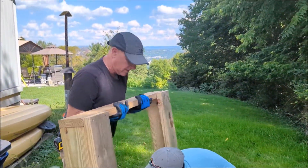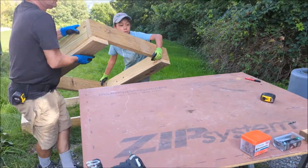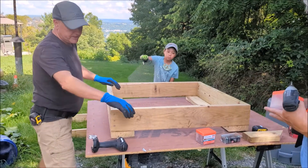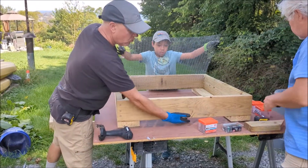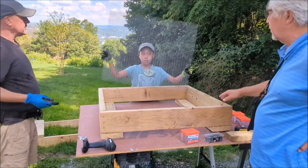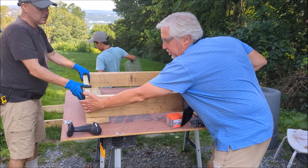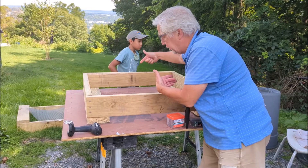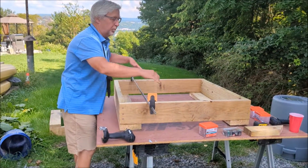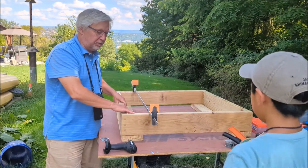This is the beginnings of our nest box — we're going to put it up on top here. This is our assembly table. It's three by three, and this is the first stage: you build a frame with two by sixes on each end, then we put one in the middle that holds the perches. Then we put in the wire mesh — that's the last thing you put in. The perch goes on first. These boards are 36 inches, and the side boards are 33 inches so they butt together. You can use these brackets on both sides to fold the boards together, and then we've got a square that we clamp inside to make sure everything is nice and square.